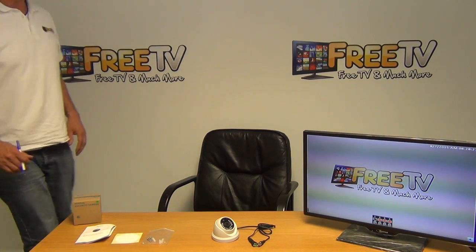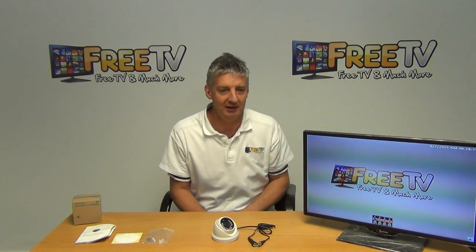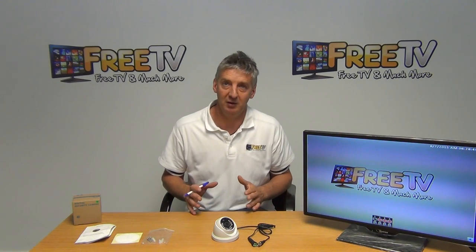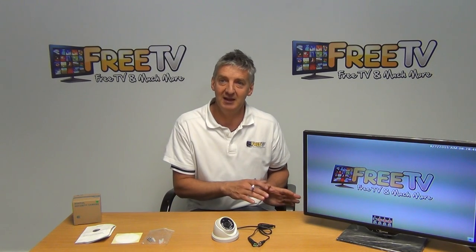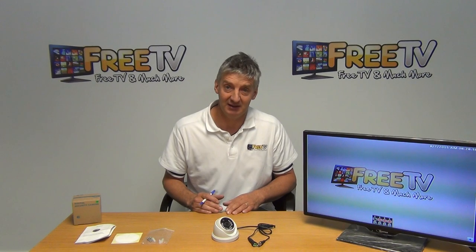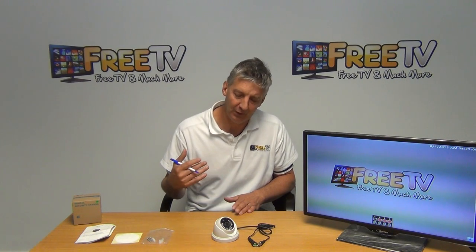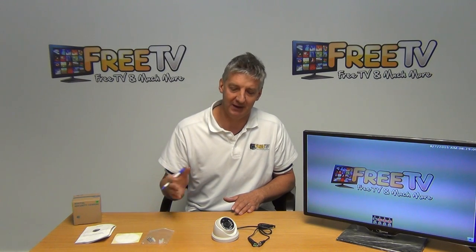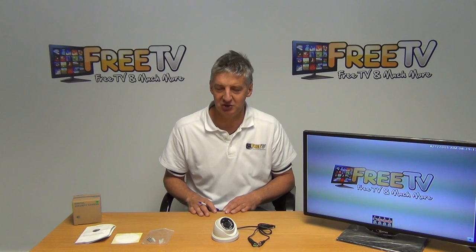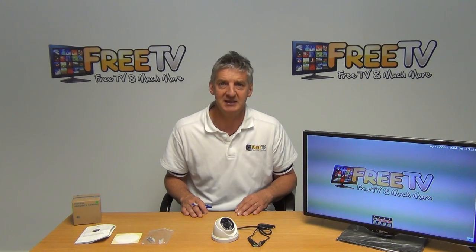In terms of AHD, we have a huge range of cameras and they've proven very popular simply because they use existing technology, skills, and cabling while allowing people to move into a much higher resolution. Typically people use a base AHD DVR with a mix of cameras — for important areas like facial recognition or reading plate numbers they use AHD technology, and for motion detection they use simpler cameras, all in a single system. A great feature is that when switching from a lower spec camera to an AHD camera, the cabling, connectors, and power unit are exactly the same — it's simply plug and play. That just makes the move to AHD simpler for existing customers and professional installers. That's it — an overview of the AHD 720p dome camera.